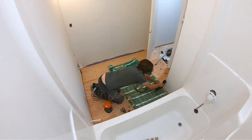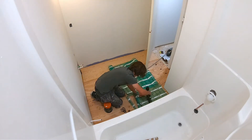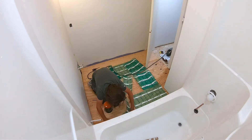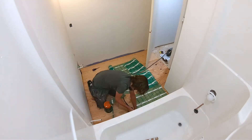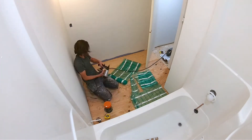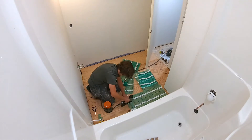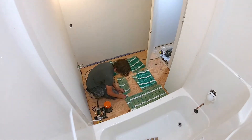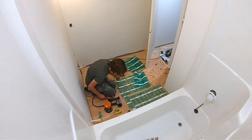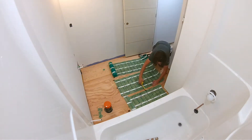The next step is getting the heating mat down. You have to size this for your room. This is from Warmly Yours. Depending on your room layout — because I knew I'd be twisting and turning it — they have one mat specifically designed to allow you to cut the matting and twist it to turn around bends. They have another style just designed for a long rectangular hallway or rectangle that is not meant to be cut or turned or twisted. I almost bought the wrong one by mistake, so make sure you've got the twist-and-turn mat if that's what you need. They do have several other options available as well.